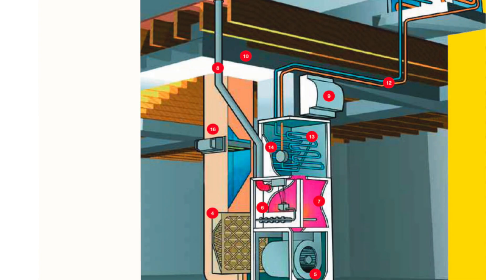But it's not killing surface stuff — germs, bacteria, viruses. It's just airborne stuff that's blowing across these bulbs. On the supply duct, right before the ductwork is a cold, damp coil known as the evaporator coil on your air conditioning system. And that coil is dark, damp, and swampy — it gets really cold and there's no sunlight. So putting the UV light above that coil can be great for fighting bacterial growth on the fins and tubes of that coil all summer long. The light shines down on it typically all year, but especially in the summer when that coil is cold from the air conditioning system.